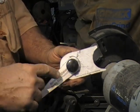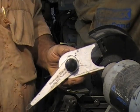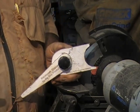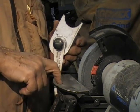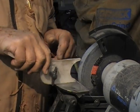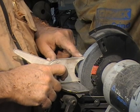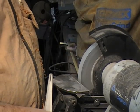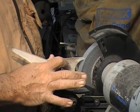Now, you cut it out and you make it up, and this is for setting the basket for your Ellsworth grind. You know how far out to put the basket. Before you set that up, take it to your grinder, move your table where it needs to be to do your grind. Your scraper, turn it upside down, and then grind those 2 points to match the wheel. What's it take? Like a minute. You match the wheel.